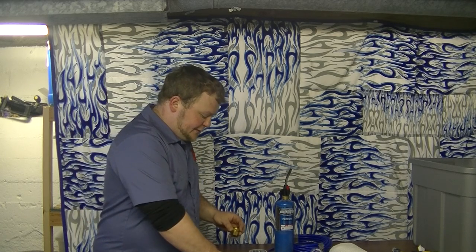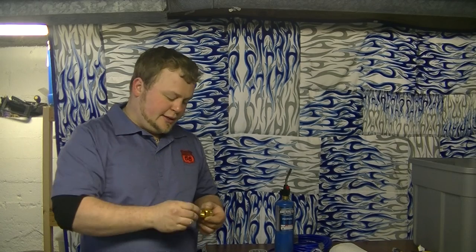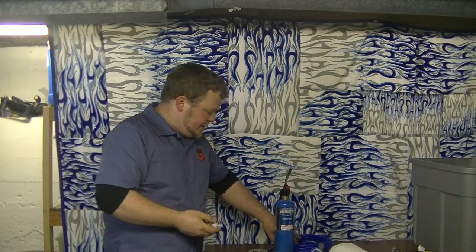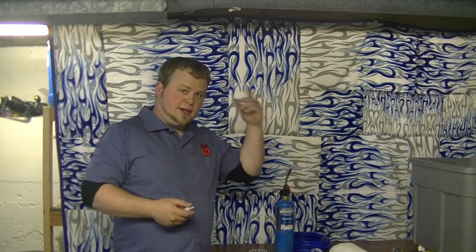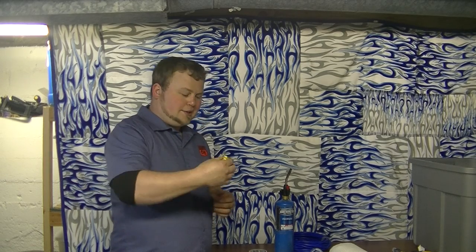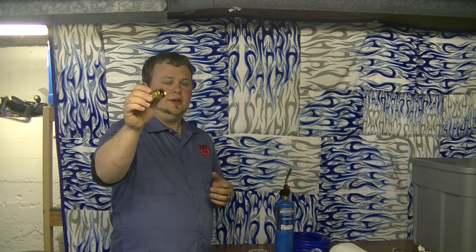So that's what I've done, is I bought a garden hose adapter, and then I got this fitting here. So what I'll do is I'll put these two together, this fitting in there. I'll heat this hose up pretty good, get it to shove down around that barb. Once it cools, it should be watertight. And then I'll cut it to size, and I'll have a quick removable hose that I can take off of there with a rubber gasket in there, so after you can take it on and off and not have to worry about it sealing back up again, because it's got a garden hose end with the rubber in it.